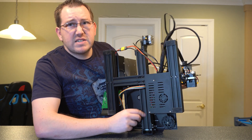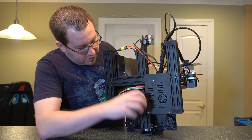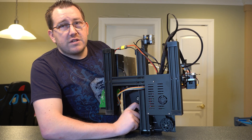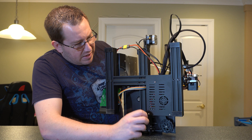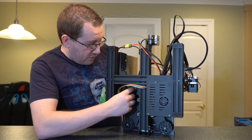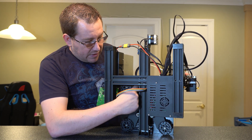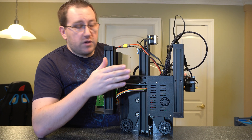Here's the underside of the printer. As you can see on the x-axis track you've got the same wheels. If you're having issues with movement - if the actual bed's moving back and forth a little too much or it's wobbly - you might have to tighten these up. You can also have the same issue where if it's too tight or something gets in the track you can damage the wheel. You also have the wheels here to adjust the spring for the bed leveling. Basically you've got the wheel, then there's a spring between the metal base and the bed itself - adjusting the wheel will raise or lower the build surface at that spot.